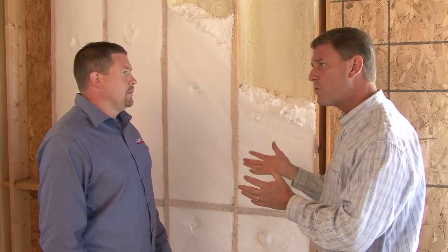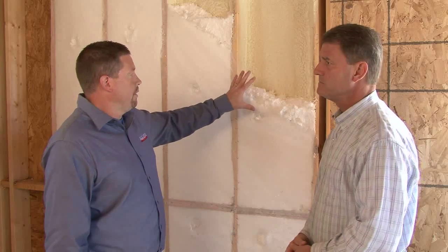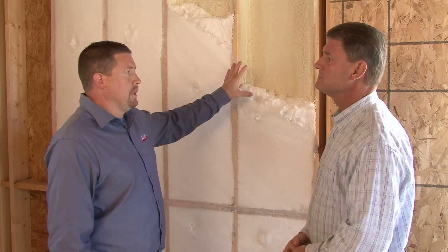Price-wise, what are we looking at — a little more expensive here? In this particular application, we've gone with a hybrid system that'll help minimize the cost. If we were to fill the entire cavity, you're looking at about 10 times the cost of traditional fiberglass. If you fill your entire stud cavity full of foam, you're not going to get back in there without a sawzall or something to cut through it. With this particular system, it's nice because you have the fiberglass in the front that'll enable you to access the wall if you do have a plumbing or electrical problem.